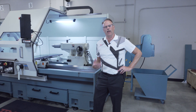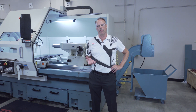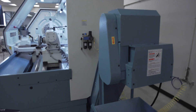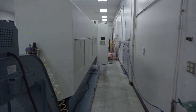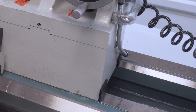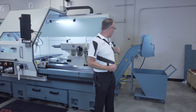Here at the end of the machine — the basic dimensions are 212 inches long by 86 by 80, and it weighs approximately 19,000 pounds. You get a better view of the tailstock from here, and you can see the trigger to add air to make it easier to move the tailstock back and forth by hand.